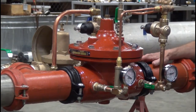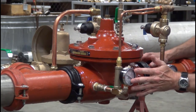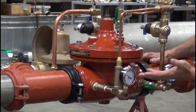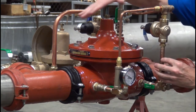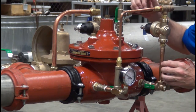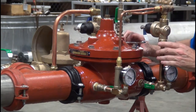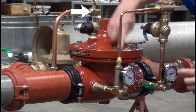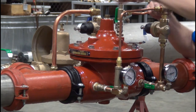In this sequence, we've got a ZW209BPG set up in the lab — a ZW209 equipped with a low flow bypass. The low flow bypass on this type of valve is excellent for applications where we have very low flow at night. For example, if we have an industrial process flowing high rates during the day, but in the evening a janitor comes in and turns on a mop basin. The low flow bypass handles those low flow rates from 0 to 10 GPM.